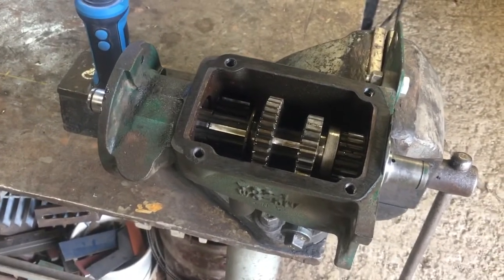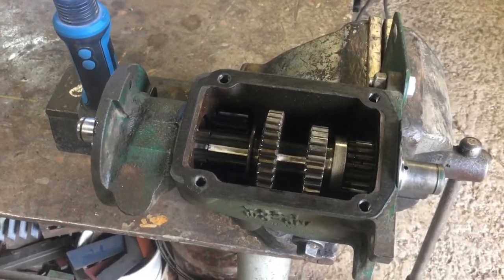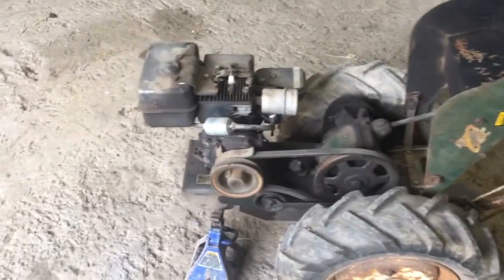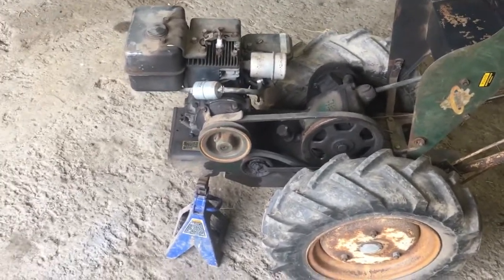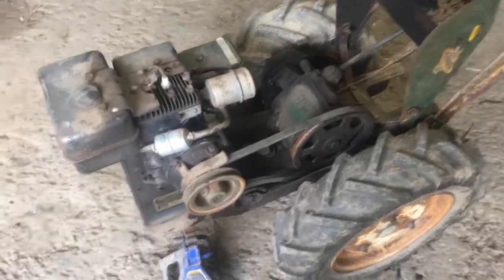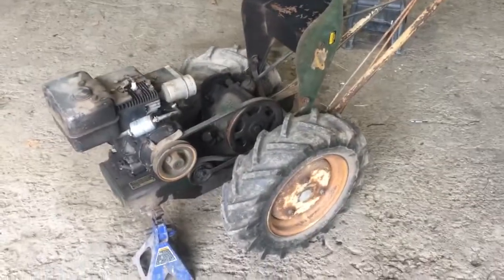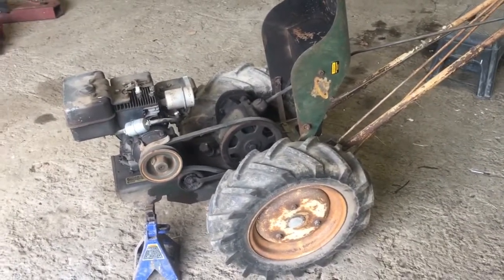It's a pretty cool little machine and it can handle about 50 pound-feet of input torque — specs are on the Olympic site. Basically it's sized for a small car or small tractor — way oversized for this application. These Briggs engines are not even five horsepower, more like three horsepower. This transmission could take the output of six or eight of these engines, even geared down as it is through that gear reducer. Little tractor, big beefy transmission — pretty cool. Hope this is useful to someone someday.